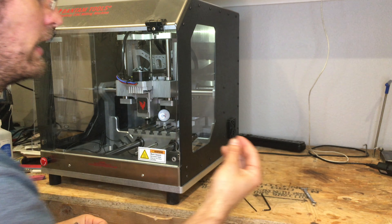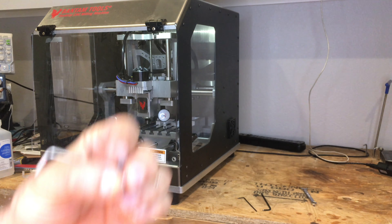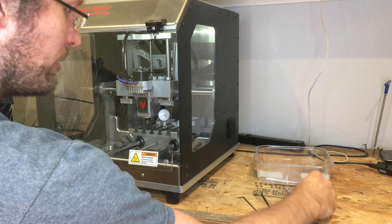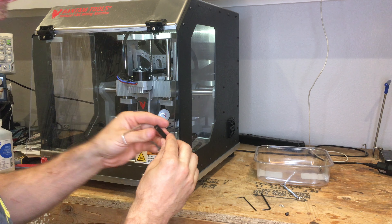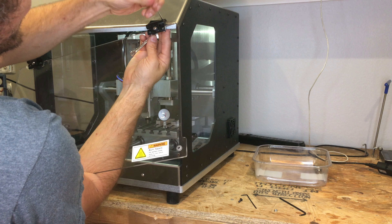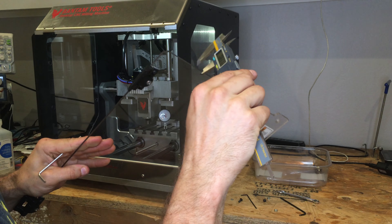They're using a split washer but there's no spring left on the split — it's a cheap split washer that's probably not going to be able to do its job. We've found our first 3D printed part — a little back bracket. It seems odd since the surrounding structure is metal. Oh, actually it's the spacers on the outside — they're using it to space the cover away from the wall, again probably because of the 2021 COVID plastic part shortage.